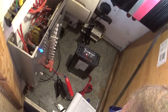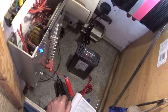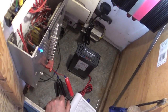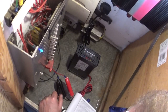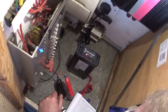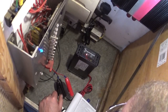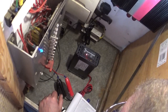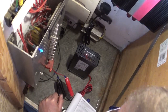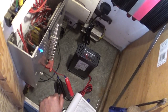Let's leave it to run and see what happens. I want to test what happens if the mains gets turned off - if the shore supply shuts off. The fridge turned on and it went down to 12.3 volts, then back up again. Now it's saying bulk charge. It's now showing afloat and everything's gone off, down to 12-point-something - that would imply the fuse has blown.